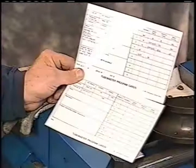Let's say you have a newer truck come in, like a Chevy, Dodge, or a Ford. You've made a difficult driver's side tailpipe. Didn't come in with one, so you've manufactured one. You've made it fit, and it fits very well. You know you're going to do more of them down the road, so you want to document that information. I will now show you how to pattern bend that pipe and record the information just like it is on a regular factory card.